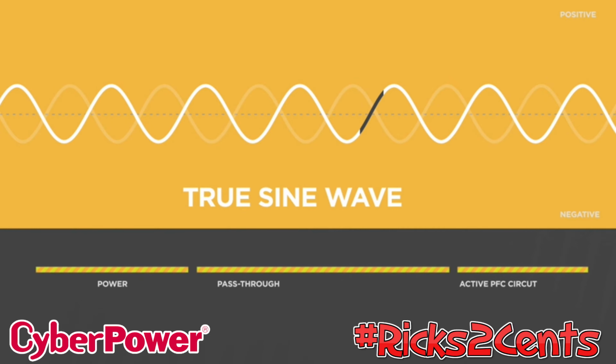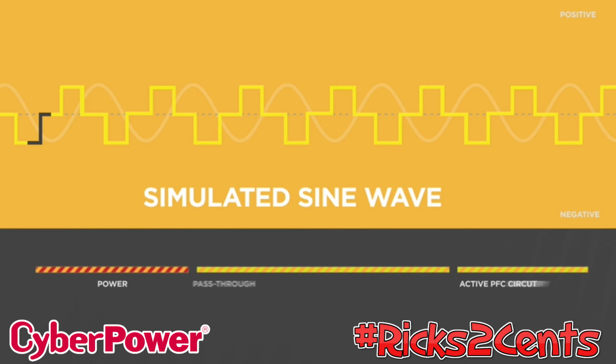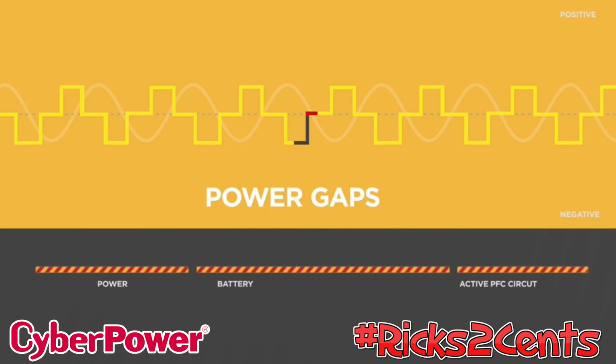Devices with active PFC circuits are designed to work best with sine wave input. Many UPS batteries produce a simulated sine wave output, which approximates the shape of a true sine wave, but with moments of zero voltage as the polarity changes. These power gaps may create stress on the equipment, reducing its useful life.